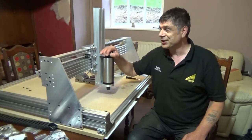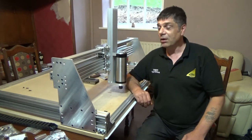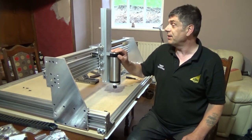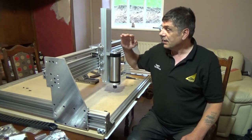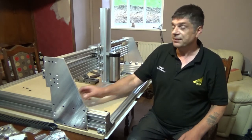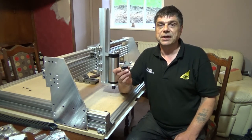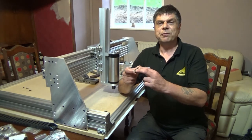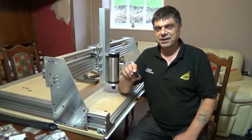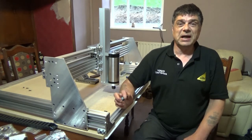So that's Spartacus all rebuilt again with the addition of the four corner block holes. Pretty much finished on the plate making side of it, apart from a plate for the top which is going to hold the stepper and some plates for the back of the acme blocks. Now I say plate because these acme blocks, when they go on, they've got little 3mm spaces between them. And to me, I know 3mm's not much, but I think there could be a tiny little bit of leverage in that. And well, I'm just not happy with it anyway.